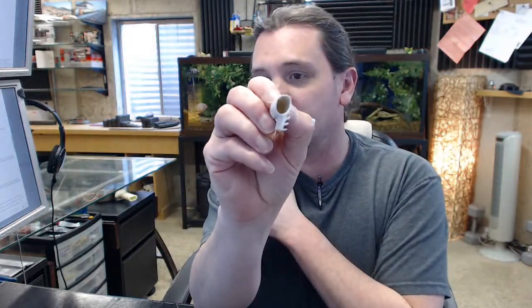That information is important to know when you are creating the frame. You have got your jamb, and the question is how far back you hold the stop from where the door will sit, because that is crucial — assuming a single rabbet frame, you have got to know how much smaller to make the stop compared to the overall door size. You have got your door pocket and your small inset of 3/32nds. I am thinking a quarter inch is where I would like to be, somewhere right in the middle. That would be my preference.